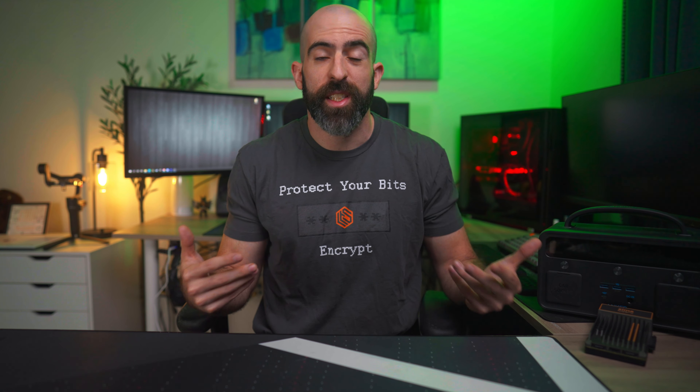It's been a few days now — let's talk about the whole experience. The goal was to see if we could host a small home lab with zero assistance from the electrical grid using the Anker power station. Did we succeed? I believe so. Using the Zima board, our travel router, and the iPhone, we were able to create a Cloudflare tunnel which allowed us to expose our services to the outside world, only pulling around 15 watts — giving us nearly a day and a half to two days of run time. Assuming a couple of sunny hours every day, you should be able to charge back up to full with a 100-watt solar panel bringing in around 50 to 60 watts. So in that respect, it was a success.